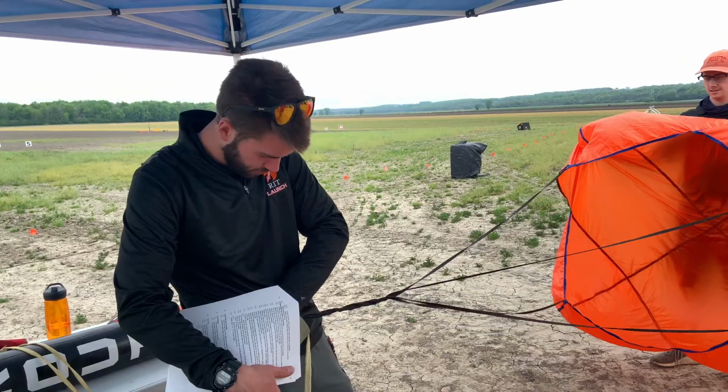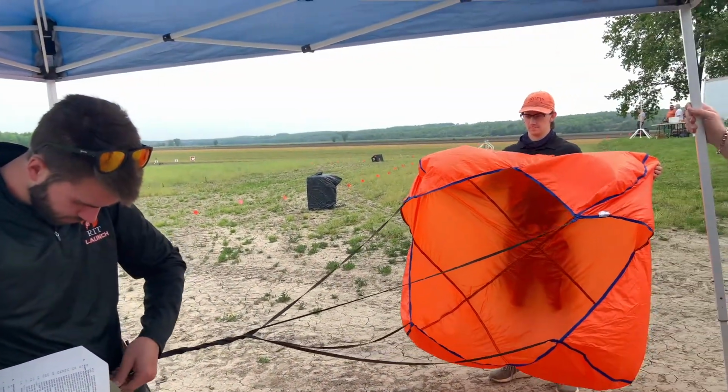It consists of 2 standard COTS parachutes, a drogue and a main, which deploy at apogee and 1,200 feet by descent. Both parachutes are manufactured by the Rocket Man. The proper parachute sizes were found using the estimated weight of the rocket with all its constituent components. After manufacturing was nearly complete, the rocket was reweighed to confirm the accuracy of the calculations and allow for any changes to be made.